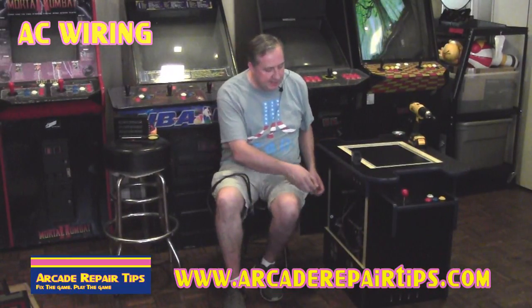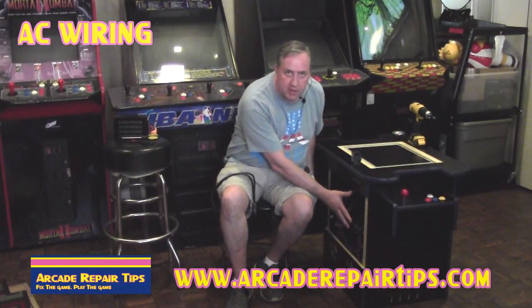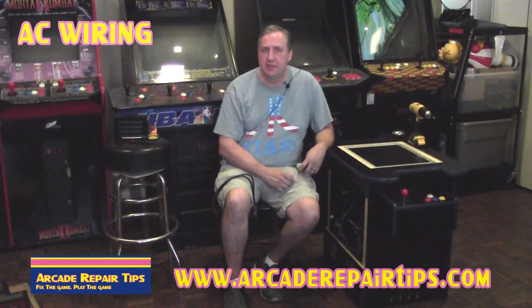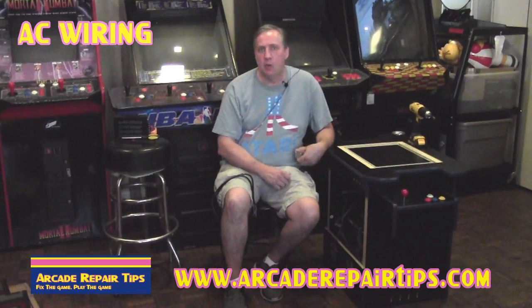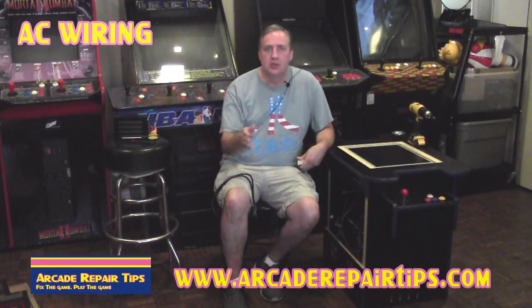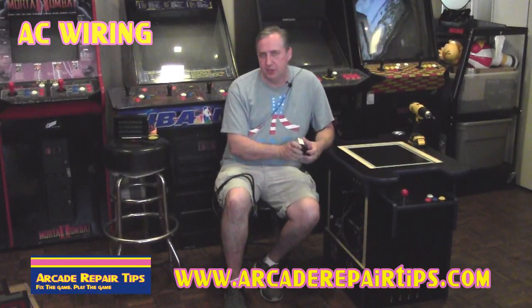Okay, step 17 tells us to put a door on, but we're not done with the wiring yet. So let's take just a few minutes and talk about wiring. Now, when we talk about wiring, we always start at power. So from the wall to the game and then so forth.